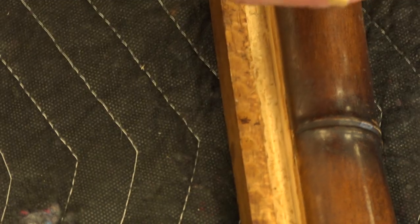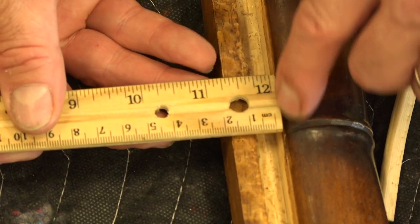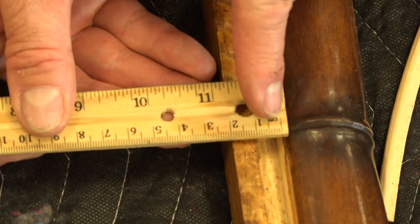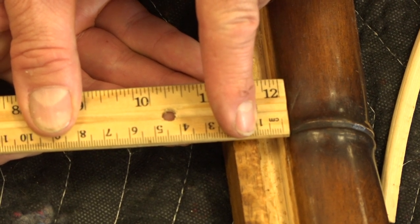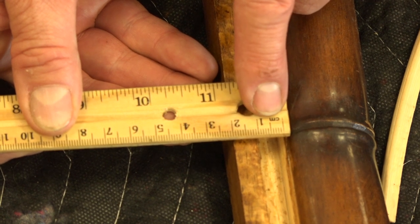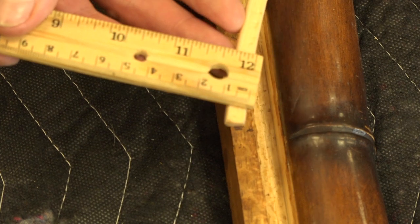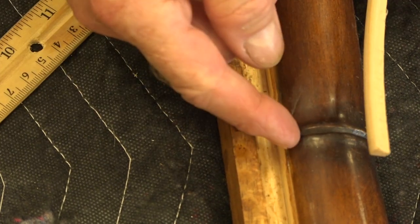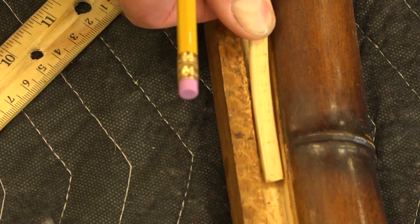All right, so the next order of business is deciding on the size of our spline. So we're gonna have to order some new spline, as you can see. So how do you know what size to buy? What we wanna do is measure the inside of our channel. So from here over to the edge here is 10 millimeters. So we wanna buy something that's a little bit smaller than that. I believe mine is a 7 millimeter spline. So that gives us a little bit of space on this side and this side when the spline sets into the channel right there.